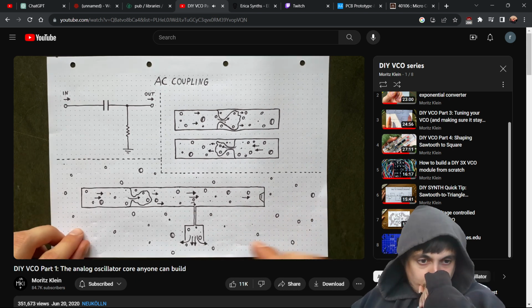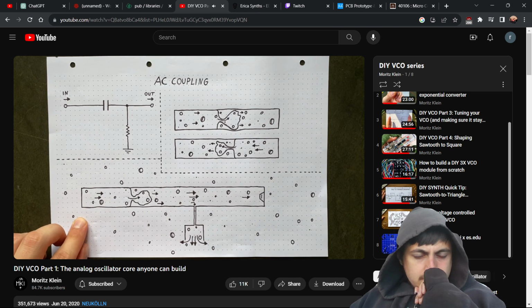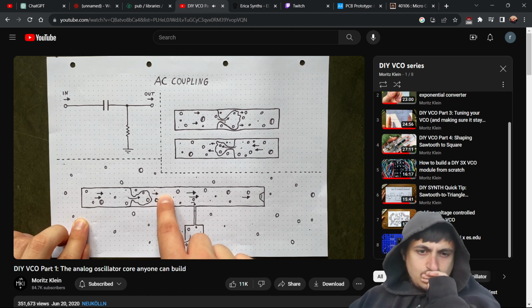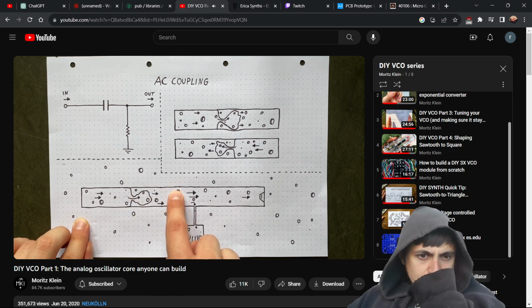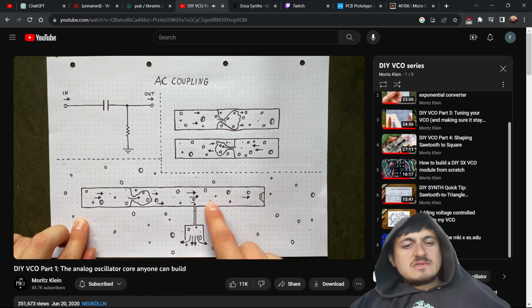Okay, so now imagine that the pressure on this side starts oscillating, let's say between 4 and 6 volts. When we start to go below 5 volts on this side, the balloon will begin contracting, basically sucking the water in this pipe to the left. This will create a negative pressure level here, like as if you're sucking on a straw, making the voltage drop below 0 volts. Then, once we've completed the bottom half of our waveform, we go above 5 volts on this side, and our balloon will inflate and stretch out again, pushing the water here to the right. And the pressure will go positive, making the voltage rise above 0 volts. So we've recentered our oscillation around the 0 volts line.